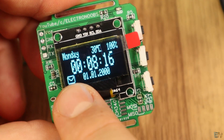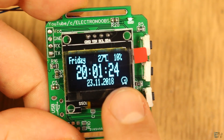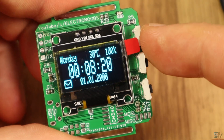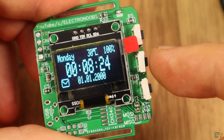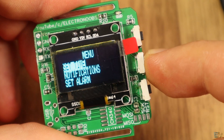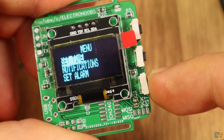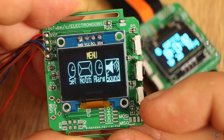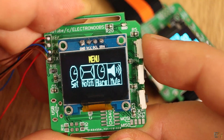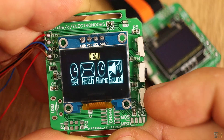It could also display a mail icon or the alarm icon, but only after I receive a notification or set a new alarm. If I long press the middle button, I enter a menu. This menu is a bit basic — I first designed some icons but that made the code bigger and occupied almost 100% of the chip memory, so I've decided to use text instead of icons.